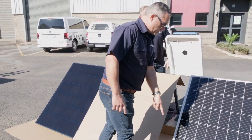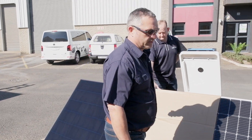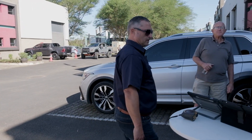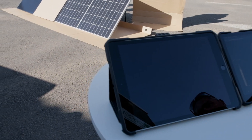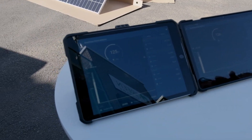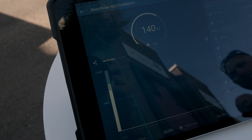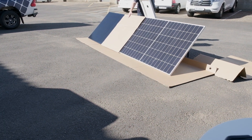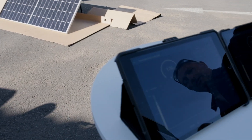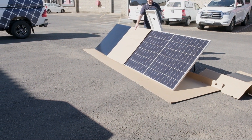I'm going to cover just the one row here — one row this side — and we've got six rows covered on the other side. Let's see what that does. So just give it some time; that will start picking up, this comes down. Because the MPPT is now trying to follow the maximum power point, it goes up and down. But you can see we've got only one row of cells covered on this panel and almost half the panel on the other side, and they're very much the same — 180, 184. Huge difference.